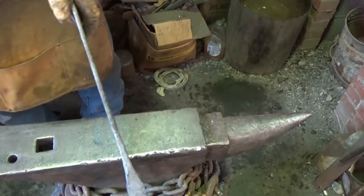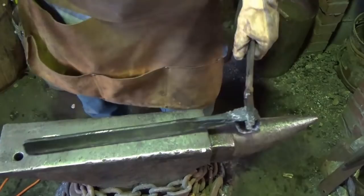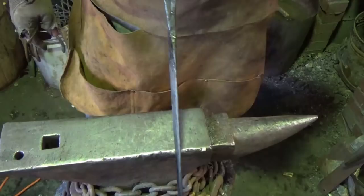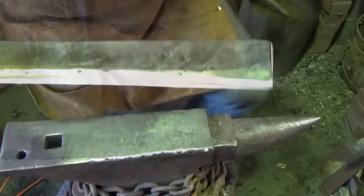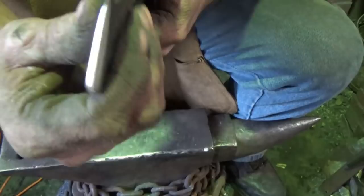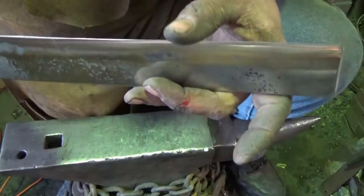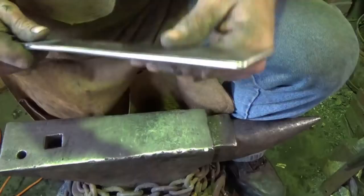We're going to flip around and re-harden it. That was fun. We just hardened it and tempered it and I'm pretty happy with the way it sounds. So we'll go ahead and grind her up and I've got to make a handle for it — we'll give her a try and see if she works. Quick grind — went down to about 200 grit. I started with the bevel we put in and then stepped that down to a little sharper bevel, then convexed and ground that all out so it looks nice and clean. It's sharp — I don't think it's cut-paper sharp, but we don't want it really sharp. Sharp enough hopefully to shave some wood if we want to.